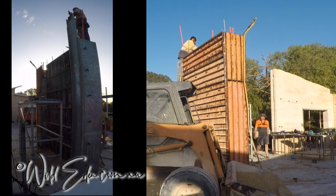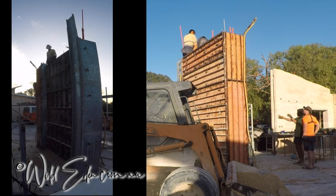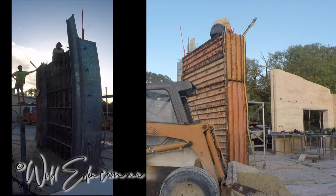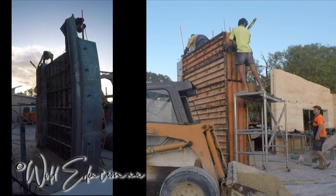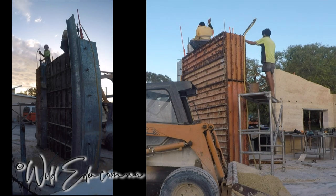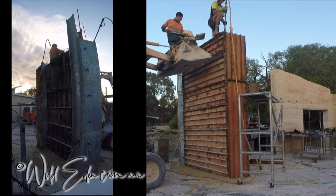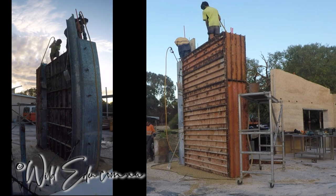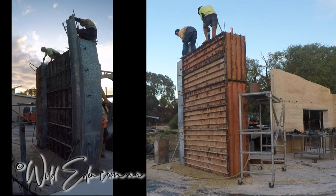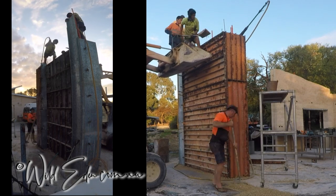But then the wall that's going to butt in and join up to that raked wall, so the pillar, we'll call it on the far, if you're looking at the left image at the moment, the bit closest to you is going to keep going up to the top of that conduit pretty much, whereas if you look at the right image, the orange forms, they're 3.6 meters tall. Actually only needs to be 3.5, so they won't quite ram to the top there. And where they're both standing there on the Bobcat bucket, when that's at 3.5, the bottom cord of the truss will go across there. That'll be an I-beam, and then there'll be uprights welded to the top cord, which will be an RHS piece of steel. Now again, if you're a paid subscriber, we'll give you the details of the dimensions for that.